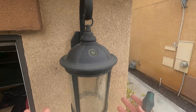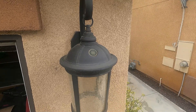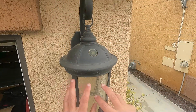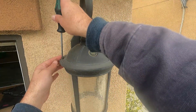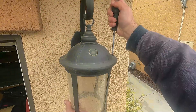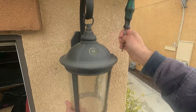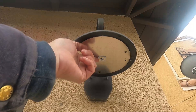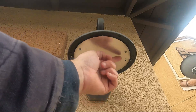Of course, I'm just going to leave it on the wall and try to do it this way. After the power is switched off, we're going to take off the glass diffuser — that's held on by just two Phillips screws. Then we can take off this reflector that holds the LED by removing three more Phillips screws.